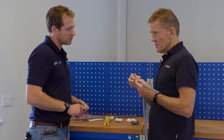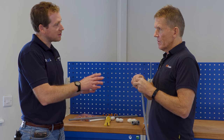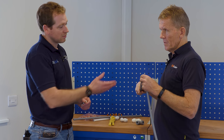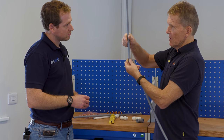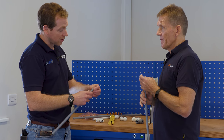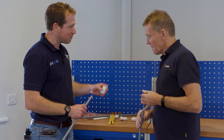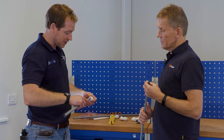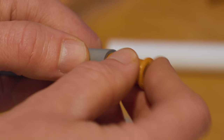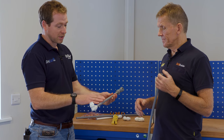Is that a snug fit in that liner? Yeah, it's a nice snug fit. Sometimes when you try different liners — is it all right to use different brands' liners with different pipe? Any insert or liner that's from a British standard system is compatible with our pipe. So if you have a van full of inserts from somebody else, by all means use them on our polybutylene pipe. There's no barb on that insert — it fits very snugly into the pipe. So take a British standard fitting — in this case the John Guest tail — insert the pipe, twist it to lock, joint made. On the other end, the Polyplum fitting — push on, joint made.